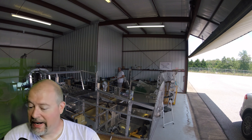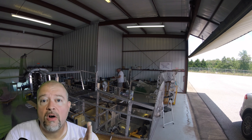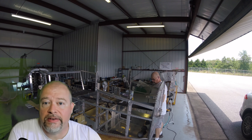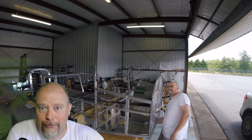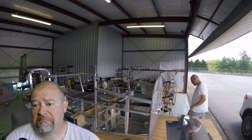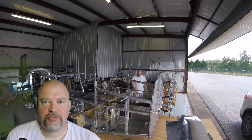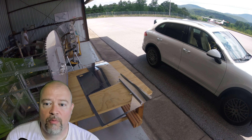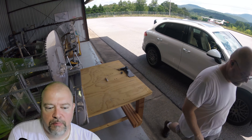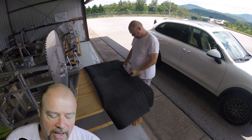In the background, one of the things you do a lot is look at the plans. I'm always looking at the plans and I realize I have to do some work on some skins — two of the skins specifically. I have to back rivet a rib on either of the aft fuselage skins, so I need my table for that. I pull the table out. The whole plane right now is sitting on the spars; I've got sawhorses on either side. The whole thing is just floating above the table — those sawhorses are solid.